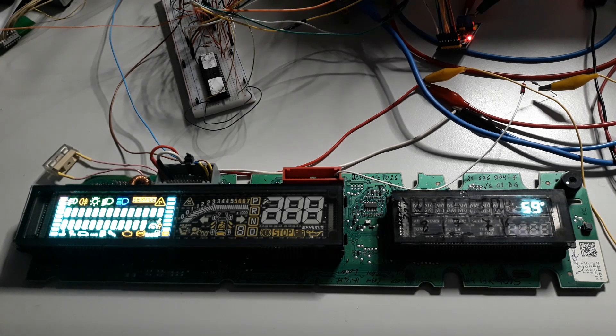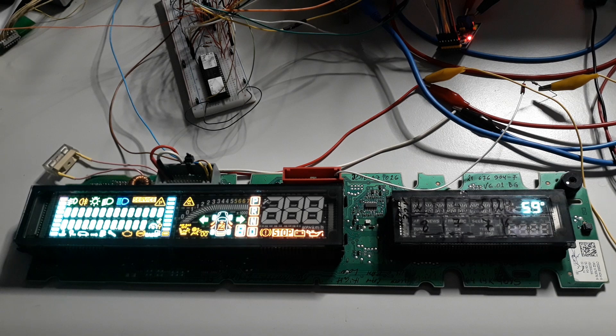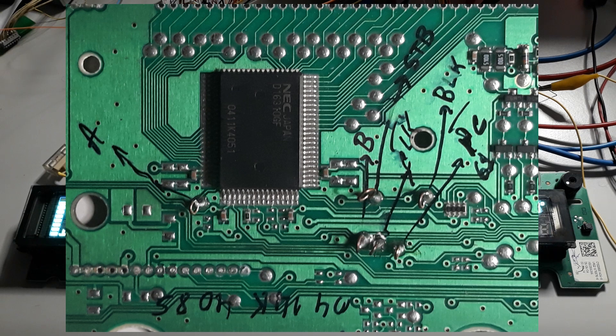It can be deduced that the second VFD is a normally controlled VFD, in this case by a positive voltage driver. It is important to note that this driver allows rotation both to the left and to the right. This is achieved by polarizing the pin R/L — when low, which is the case in this panel, it is connected to GND. The data input pin is B; the other way it would be A. I applied notes on important points of this input driver but didn't dedicate too much time to them so the video would not be too long.